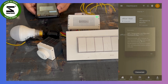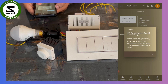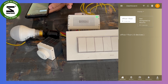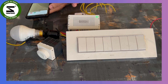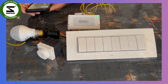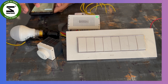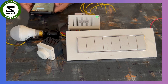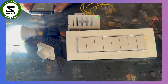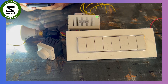Press Connect and you will see a success message: 'WiFi parameters configured successfully.' The moment it's configured successfully, the green light will start blinking slowly, and if the name and password are correct and WiFi is within range, the green light will become stable. Since the green light is stable, the WiFi configuration is successful and you can now control your devices — switch on and switch off the bulb from the mobile app. This is how you do the WiFi configuration. Thank you.